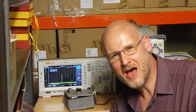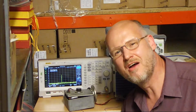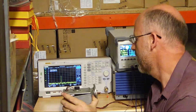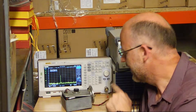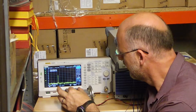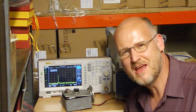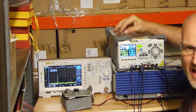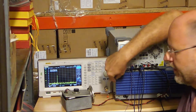Just to close and round up: we've been looking at the output from this klystron. Right now you can see the center frequency is around 5.69 GHz — that's the output from this klystron oscillator. That's probably about 50 milliwatts or so. I can very clearly see the frequency can be changed by adjusting the bias. That's a nice example of a klystron oscillator. We've demonstrated the fun you can have with Rigol's new 7.5 GHz DSA 800 series, the Rigol DP800 power supply, and of course the faithful Kikusui PWR professional high voltage power supply. Thank you very much for watching.